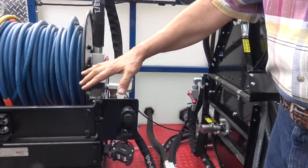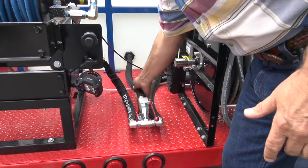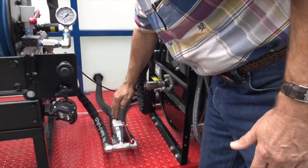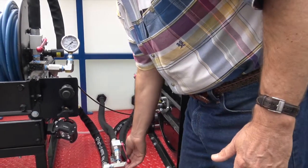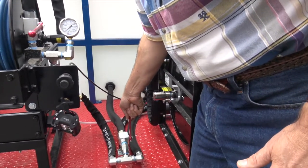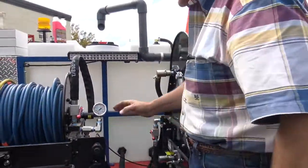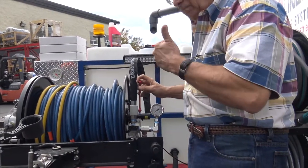Okay, that's the off position for the hose reel. This is the on position for the starting position. Again, that's off. It's against the grade. So when you start this, that hose is going back to the tank. Lose my voice a little. All right, so when you want this to go to the hose reels, right there, that's on for the hose reels. This is your easy start valve. Off, on. Now you're live to the hose reels, and then when you're ready to jet, that valve's on, right?